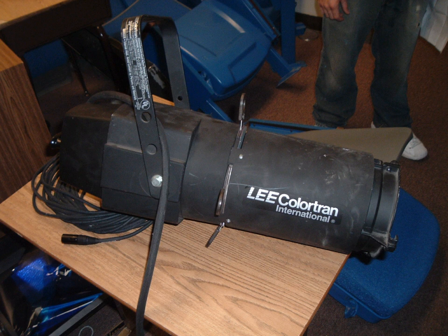There are one or two plano-convex (PC for short) lenses within the lens tube that create the lens train. The plano-convex lenses, named for having one flat side and one convex, bowed-out side, have their convex sides facing each other within the tube. The distance between these lenses and the distance between them and the reflector determines how wide the output beam of light is. There is a set of brackets on the end of the lens tube for the insertion of gel frames, a color-changing unit or any variety of accessories. Most modern units include two slots that allow for combining different accessories.